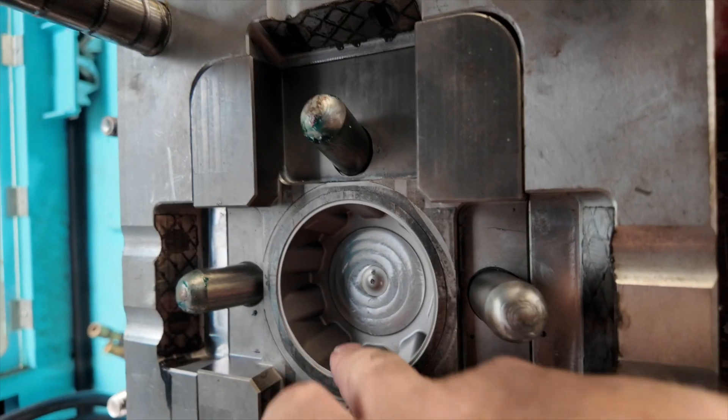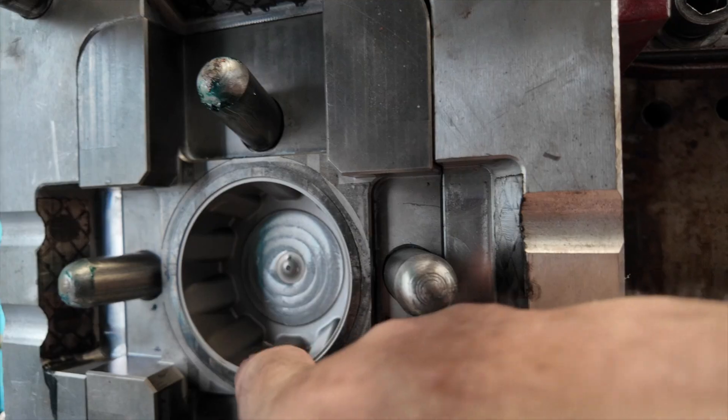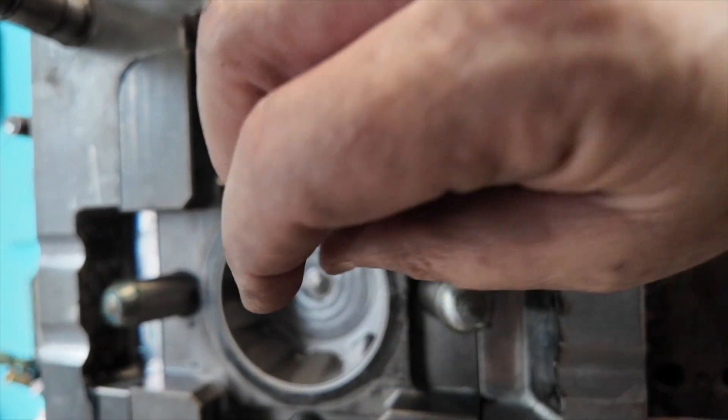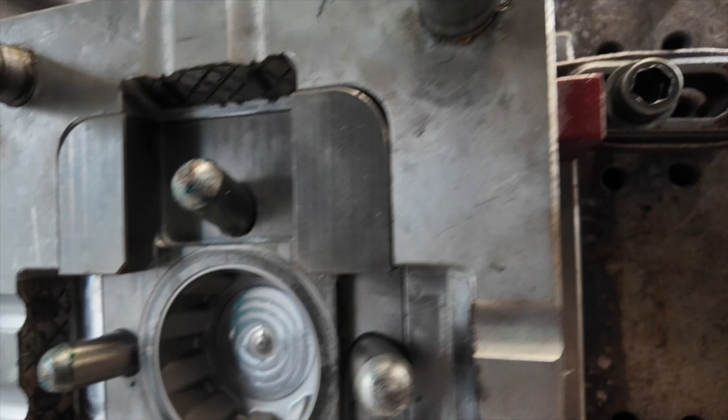This is also what we call a spaghetti tool because there's just water everywhere on it. We have to run hot water. The die actually has to be about 60 degrees to give us a really good finish. If you notice that finish here, there's actually a finish on it — we copied an original old SSR cap to get the same sort of finish on it, and that's what we've achieved. So to get the plastic to actually flow into there, we've got to run the die at a temperature. Going to spaghetti tools — water everywhere on this.